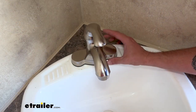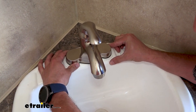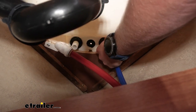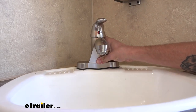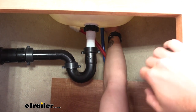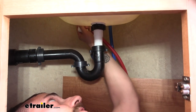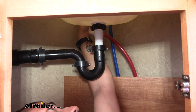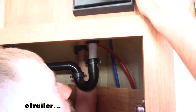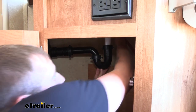Then we can hook up our water. I don't have this fully tightened down yet — I've got it about 99% of the way. I left enough just so I can move this around to center it exactly where we need it. Once you find your center, you can go ahead and fully twist on those little rings and get it nice and tight in place. Give it a little jiggle up top on the faucet itself to make sure it's nice and secure. Now I'm screwing on all my water lines, and we do want to make sure we get these nice and tight, otherwise you can end up having a leak. One thing I like to do just to ensure there's no leak is put a paper towel or shop towel under it — it will show if it got wet because it will dry and crinkle up a little bit. Stick one of those under your faucet for a day or two and see if anything leaks out over time, and you can adjust accordingly.